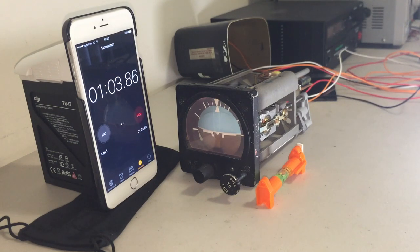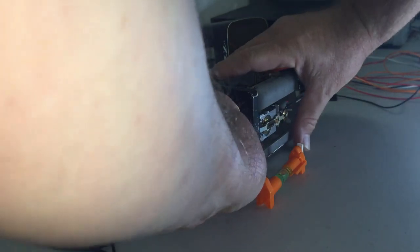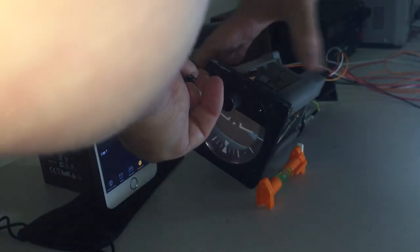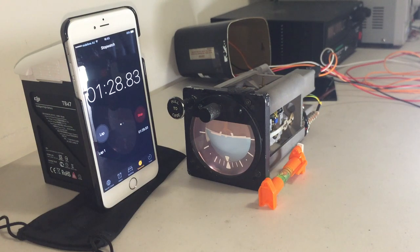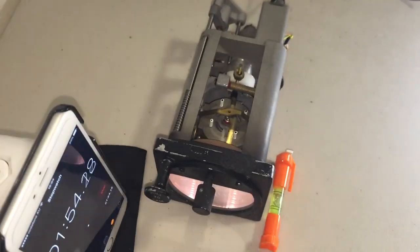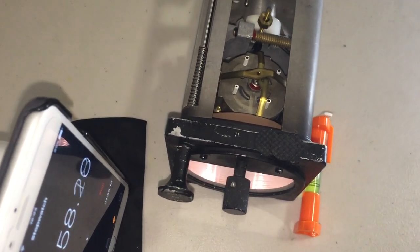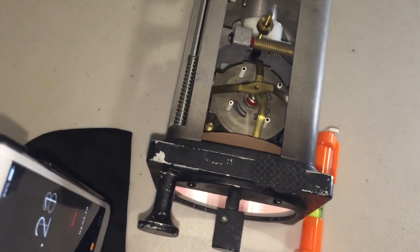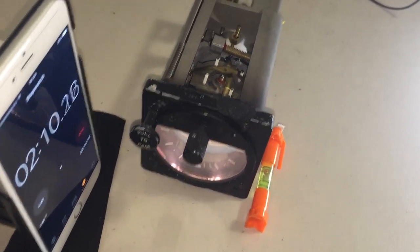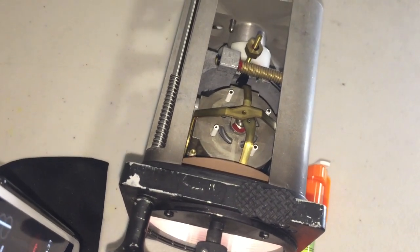That's quite nicely leveled, so I'll cage the unit and turn it upside down and then release the cage. As you can see the unit is upside down. If we look down from above, the gyro is upside down — those are the pendulous vanes at the top, so they're now taking action to self-correct the gyro back to level. As you can see, the case of the unit is upside down, but that is irrelevant because it is the internal mechanism that will align back to level.